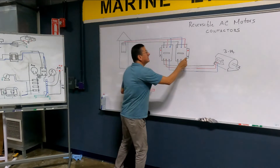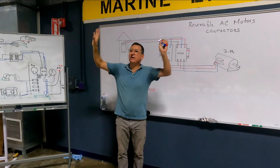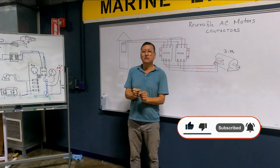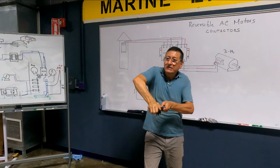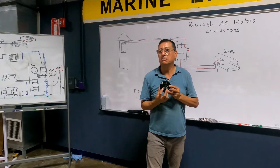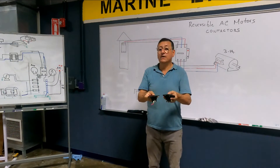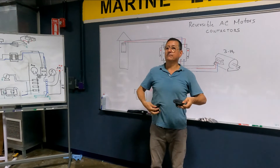I am going to activate those contactors with DC — DC from the battery bank, house battery, any battery bank. In my console I am going to use push buttons — for example, toggle switches for up and down. This is a push button. Where is it located on your boat? For the anchor. When you press the contact, this and this will be connected. If you check continuity right now, nothing. When you press — beep — continuity. I am going to install a couple of momentary push buttons, one for up and the other for down.